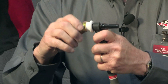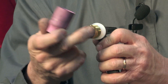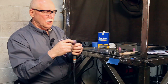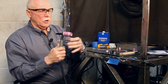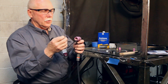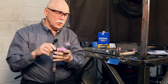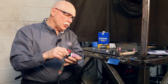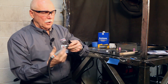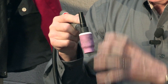This large lip on here allows our cup — our large nozzle — to seat against it. Now we have a much larger gas lens surface area, a much larger flow of gas that takes a higher flow rate on your torch, but you cover a much bigger area. The advantage is that you can move further and not lose your shielding. With a small gas lens you can only move maybe a half inch before coming out of your shielding, and the material will still be above 400 to 600 degrees and will react with oxygen. With this large lens, it allows you to move maybe three quarters of an inch before leaving the gas shielding.